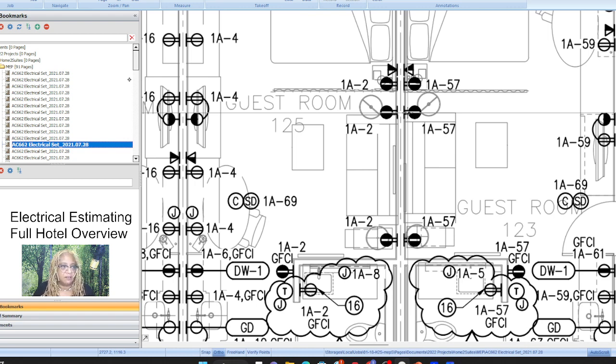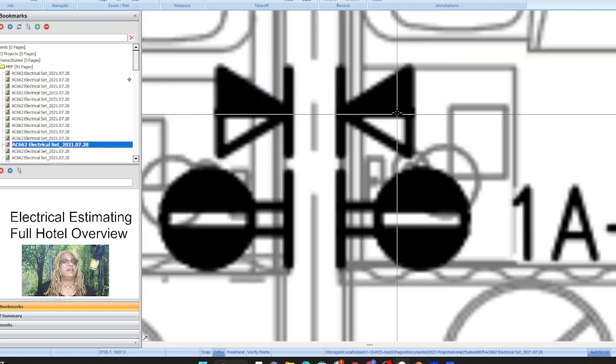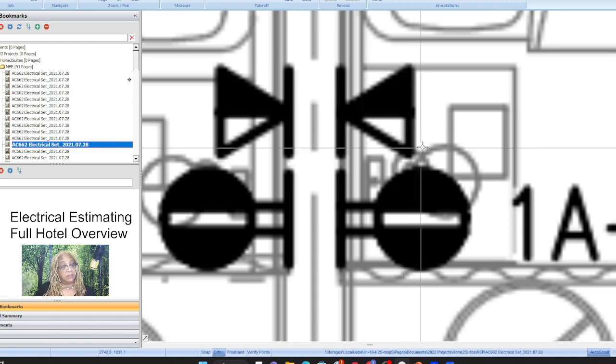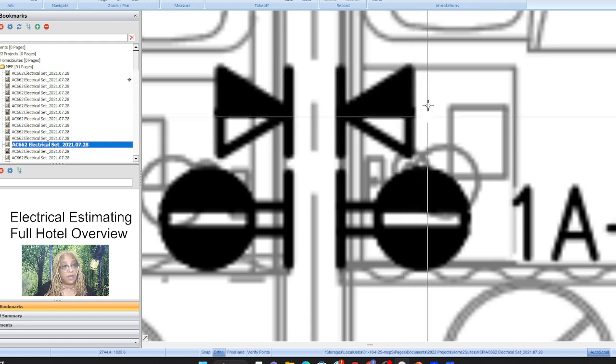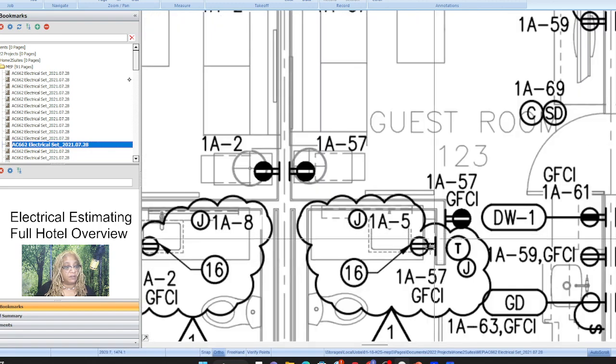You see, we kind of know, because the outlet goes inside the junction box, but the outlet is the high voltage electrician scope of work, so we don't question that junction box. It's just the one for the low voltage electrician scope of work that we have to provide the junction box. A duplex one when we have data and phone, so it has to accommodate two outlets, or just a single one. And it's the thermostat, but it has to be big enough. So they have to coordinate.